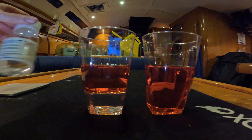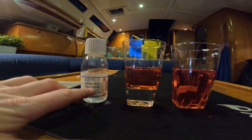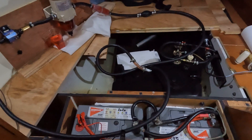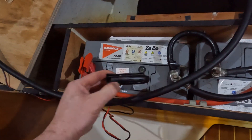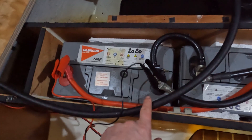You can use bug treatments like Marine 16 - this is the thing that was recommended to me and quite a lot of people use it. But even so, I still had a little bit of an issue, which I'll show you in a bit. I just switched it off for two shakes of a jiffy - this is why I've used a long hose because my tank goes quite far back. Just checking if it's hot - it's not, so happy to carry on for a little bit longer. And this is why you don't use it for petrol - the fumes could blow you up.